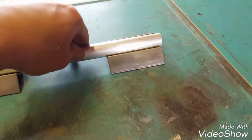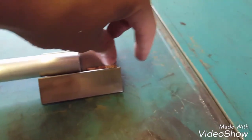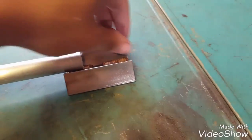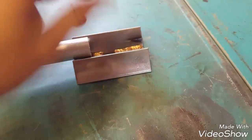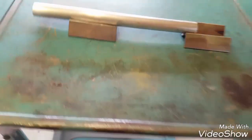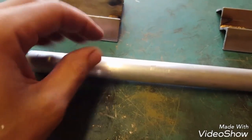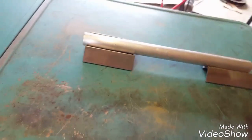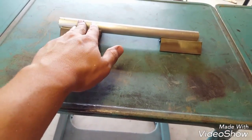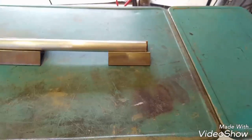If you're putting two pieces together, put your other piece here — either have a third V-block or just push down real good and make sure it's locked in. Then move it back, put the other piece in, tack it, spin it, tack it. The other thing that's really nice is when you've got to drill holes into tubing — if it's wanting to spin, you can set it in the V-block, grab your drill, and go straight through it no problem. If you've got a pipe with a curve to it and you need to hold it still, this will work well, and you can put a block behind it to keep it in place.